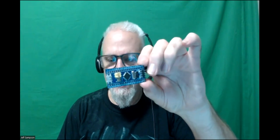I'm not going to turn my background back on yet. So on my encoders, I said I just got the wires hanging out. I have to hook it up to something to actually make it work. So I was digging through. These are the blue pill boards. It's like a $3 board, and it's got an ARM F103 processor on it. And this particular chip you can run up to 4 quadrature decode channels. It's got hardware built in to do that.